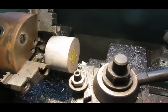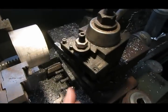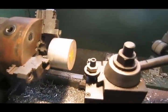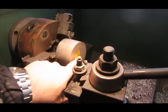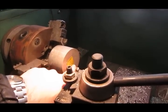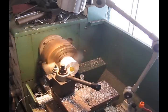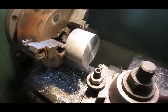Now I have this set up pretty well. You see this threaded collar nut on the tool post — I can use this to adjust the height of the tool, because we need the height of this tool to be lined up exactly with the center line of rotation. When I machine this cut, if there's a little stub left in the middle, that means the tool is either too high or too low and doesn't reach all the way to the middle. My cut went all the way to the center of the piece, so I've got the height of the tool set correctly.